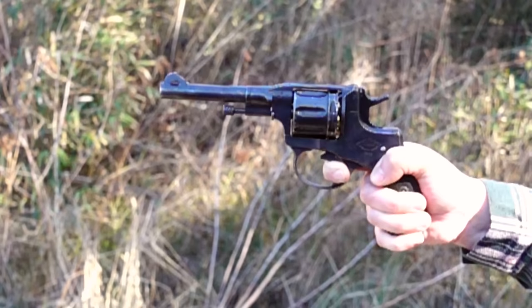And you'll see it, the back of the cartridge is tapered, right? Because the breech block comes in at a slight angle, and it has to kind of heel up and press. On the available ammunition to us, it wasn't a perfect fit. It would drag and snag a little bit.